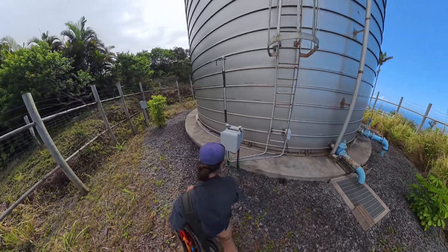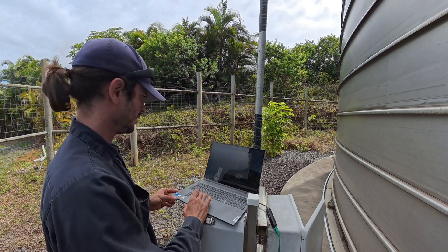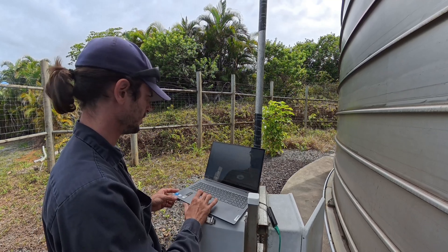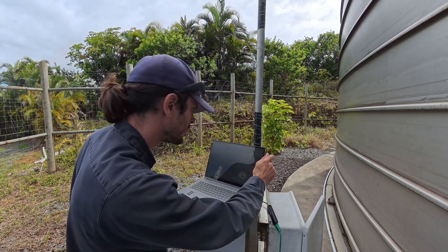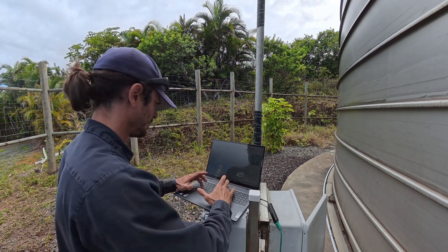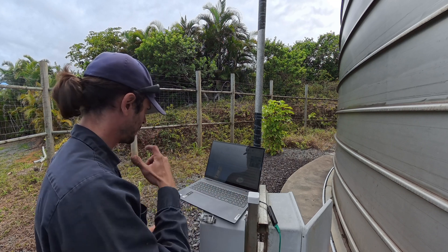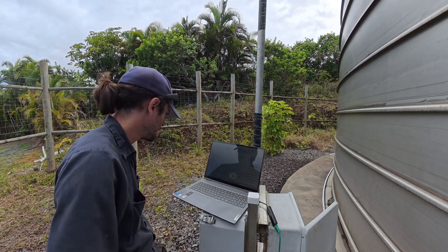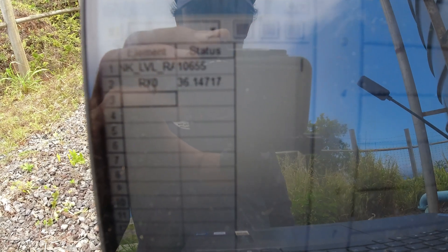Alright, we're connected to the PLC. We want to see wx0 — there's really not much going on here. rx0 is our scaled output and it's bouncing quite a bit. Let's pull up a data window: wx0 is our raw input, rx0 is our scaled output, and yeah it's bouncing quite a bit — 10,000 to 12,000, 36, 35, 40, sometimes higher.